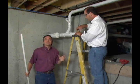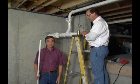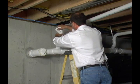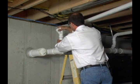Well, if you're really nervous about plumbing, the rest of that was pretty easy to do yourself, the carpentry, the plumbing, and everything else. But when it comes to tying into the house, you may want to get a professional like Mike involved. Mike, what is critical about the tie-in to the sewage line? Really, there's 3 things that are important. First, making sure you use a Y instead of a T connector. Because with the T, the pressure would bounce right into the joint, and a Y flows along the line.